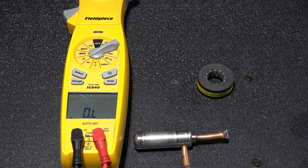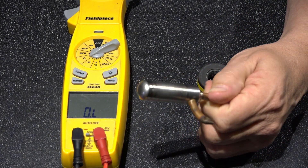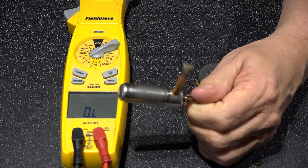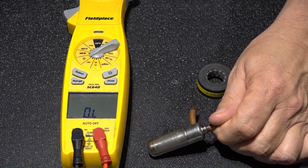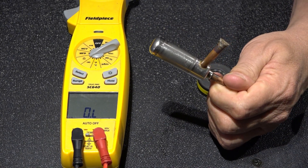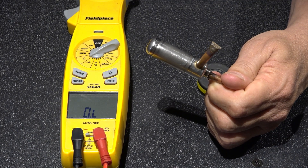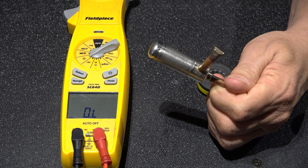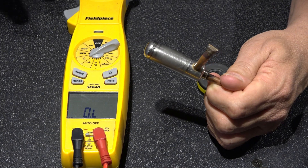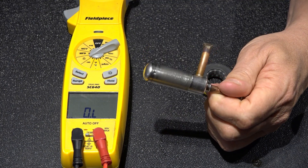I do have a new tool I'm trying out - it's electronic and runs off a nine-volt battery - that's going to try to unstick some of these valves. I haven't had a chance to really put it to work yet, so we'll do that in a future video. Normally the power heads controlling this are powered by 12 volts DC, firing on pins one, two, three, and four to common - just pulses of 12 volts DC moving in a clockwise or counterclockwise position to open and close the valve.